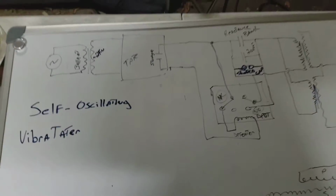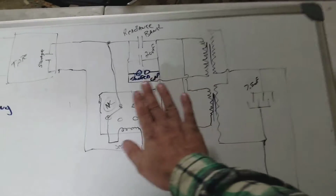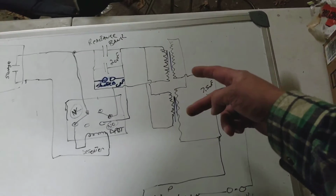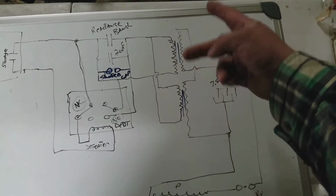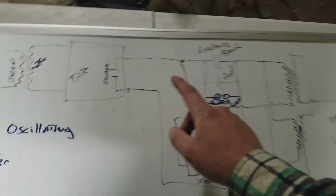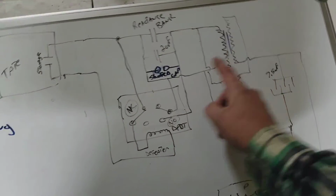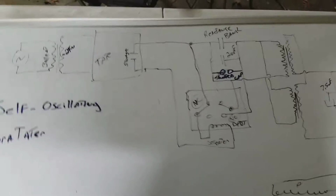You know, some other previous videos showed the effect of how a high voltage step-up coil, whether it's an ignition coil or neon sign transformers, these mini ones I have here, or flyback or whatever you want, drives a standard Tesla coil circuit. However, that's not really the part I want to show you. The fact is, I found that I can induce oscillations by collapsing these coils when the output of the Tate gets shorted.